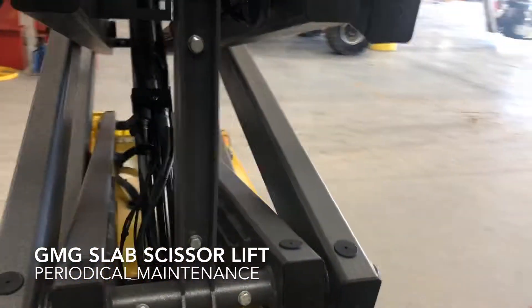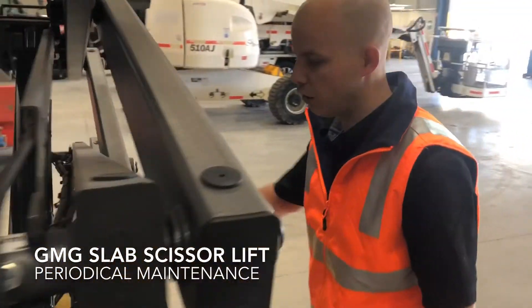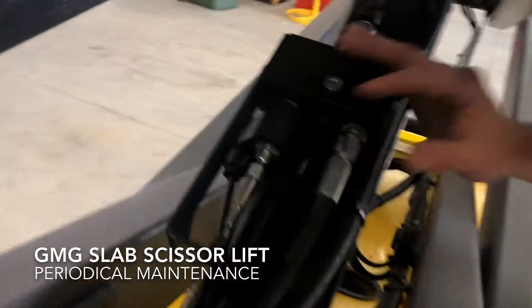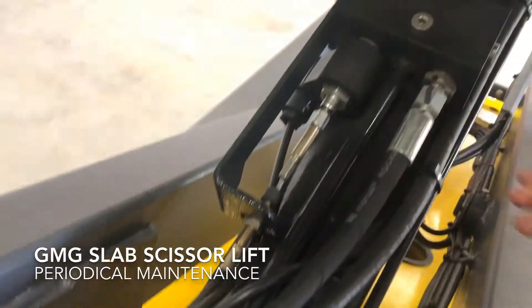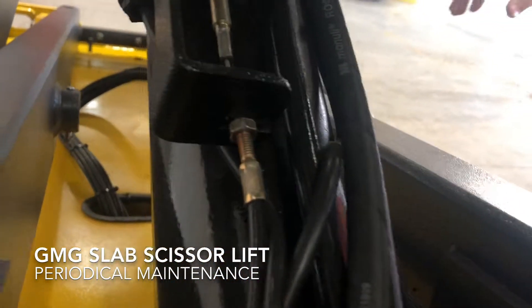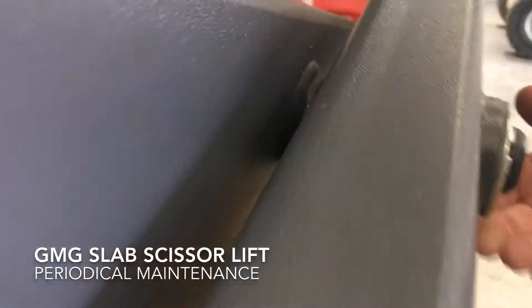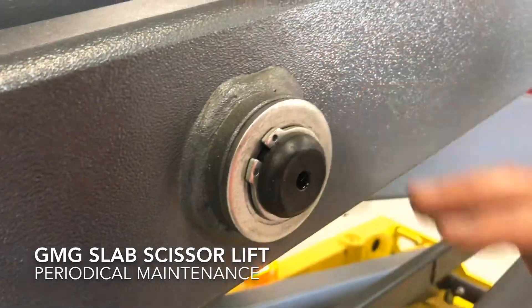The machine structure is now safe to access for closer inspection of our lift cylinder hardware. We're checking for any oil leaks evident. We're checking our emergency descent cable, making sure there's no defects. We're also going to thoroughly check each of our pivot stacks, each of our pivot points, and all our mounting hardware is firmly attached.